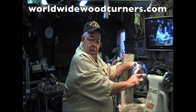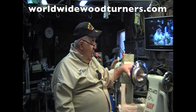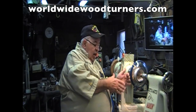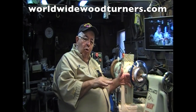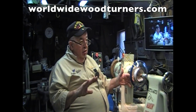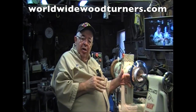And I'm using, again, the soft touch. The soft touch is not going to scratch my material. This is plastic, and it will scratch. You can't put the point in it. That's bulletproof. All right. So now I'm going to turn it around and I can sand this inside. I can sand this outside and come all the way down to just about the center. And when I get done, maybe I'll take my pad and go 4,000, 6,000, 8,000 grit paper and clean it all up, orbital, instead of putting lines in it.